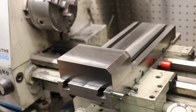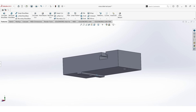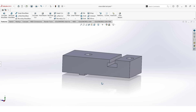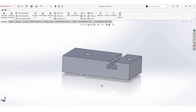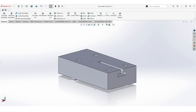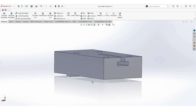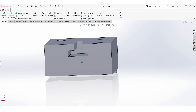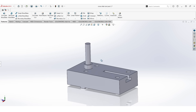I think that looks a lot better. Now I'm going to make another design change on the fly, though unfortunately it is going to cause me a few issues in a little bit. The original plan was to use two bolts to hold the compound down and have a T-slot run up the right-hand side to mount mist coolant or indicators using a T-nut. However at the last minute I made a design change to make the T-slot run lengthways instead. I can still use this for holding indicators, but I can also use it for holding the tool post in place — for example, if I need to shift the tool post to the left I can easily do that. This will be in addition to a fixed tool post stud, giving me options for unusual setups.